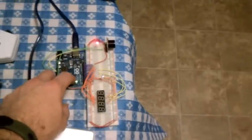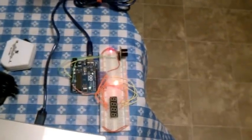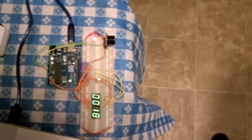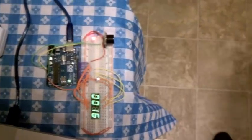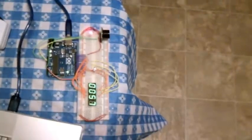In this third implementation I'm going to show you the whole process. It's got kind of like a startup — 3 flashes and then 20 quick flashes. As you can see, this one is much more stable. I'm taking the median of 15 samples, each sample is 10 milliseconds apart, so the sampling rate is just under 7 hertz.